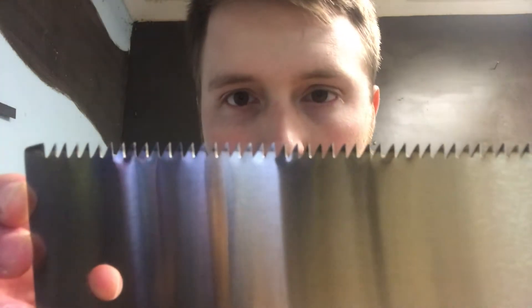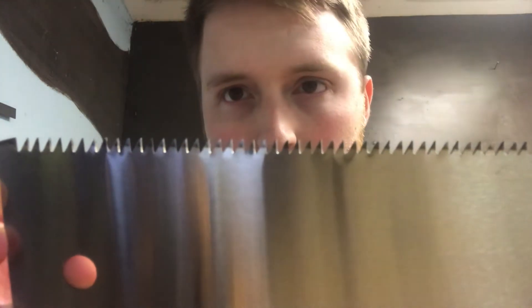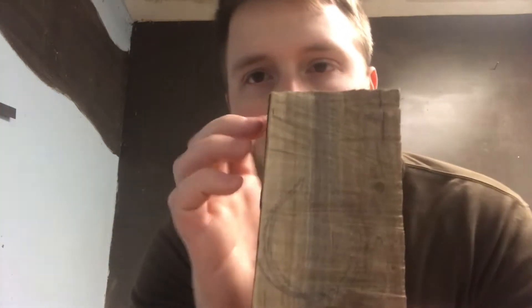I have my template here, just kind of roughed out a little bit with a pencil. I got a new saw that I'm going to try to use to cut this thing out. This is a Japanese style saw and it has two sets of teeth. This side has coarser cut teeth and it's made for ripping with the grain. The finer teeth side is made for cross cutting. On this spoon I will use the coarse side to rip and the fine side for the cross cut, which I'll probably do first.